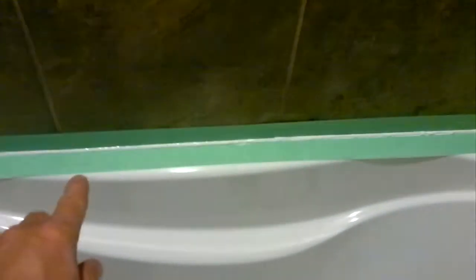This is just a good trick for doing the caulking — we're in the process of caulking so we just tape it, and it gives us a nice line. Smooth it with your finger and then pull the tape off. And like I said, we have the double shower heads.